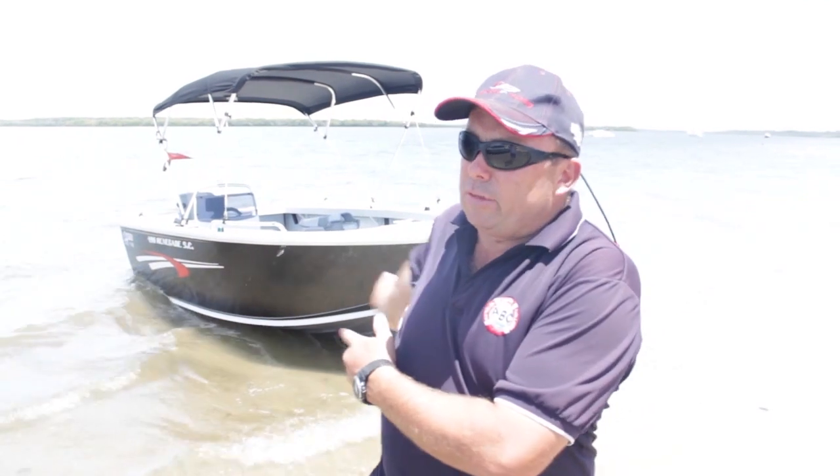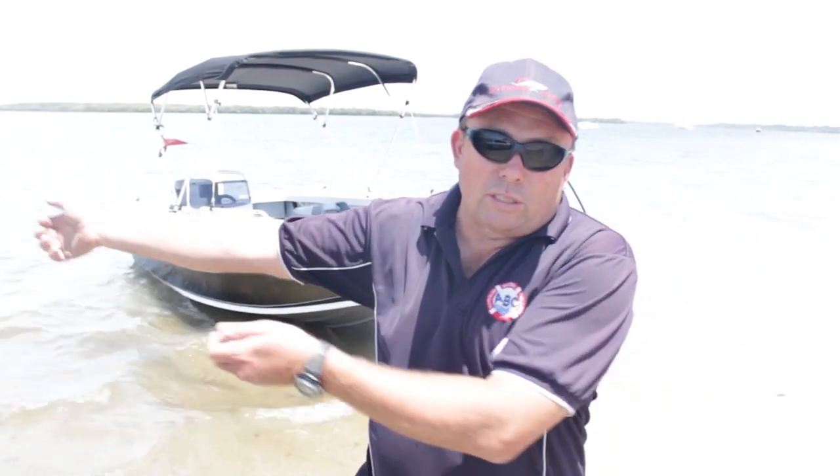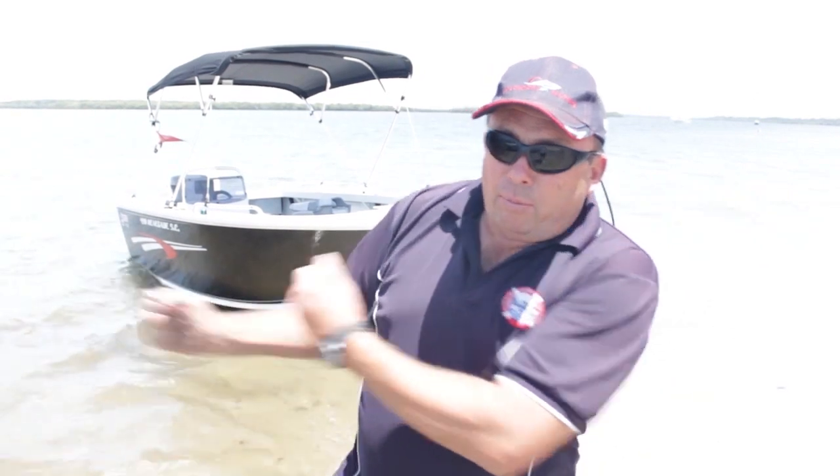I'll just swap the other side. The biggest trap when people try to put a boat back on the trailer is they come this side and try to pull it up into the wind. I always go the other side and let the wind bring the boat round and help me, especially when I'm on myself. The strap's already down — all I do is hook the boat onto the strap, pull tension on the strap, walk up, wind the winch on until I've got enough strap. It'll self-centre itself with that Quintrex open-back series trailer.